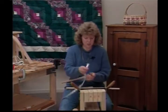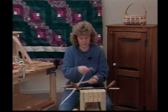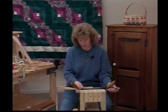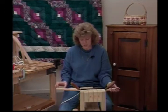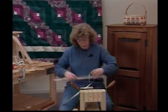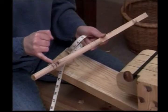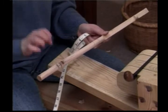And I cut these about 22 inches long. So, whoops, wrong side of my tape measure here. So I just take a pencil. Oh, this one's 24. And I mark the center. And I mark 3 inches up from each end. And if I'm going to put a handle on here, a grab, then I'm going to mark that out too. On this one, I've already marked it out. Here I've got 3 inches. And here's my half inch mark,